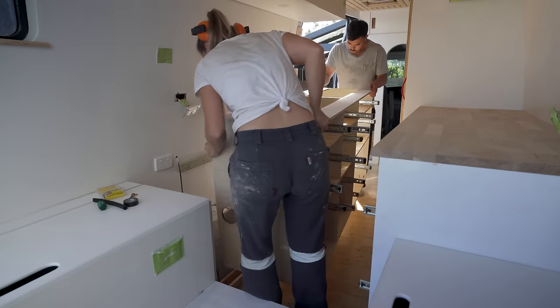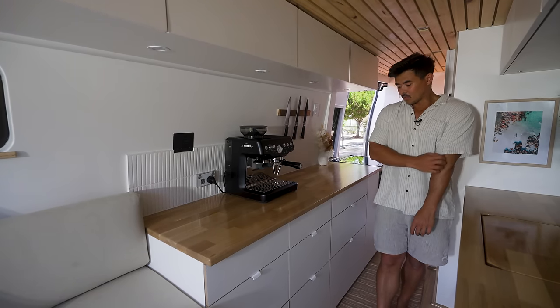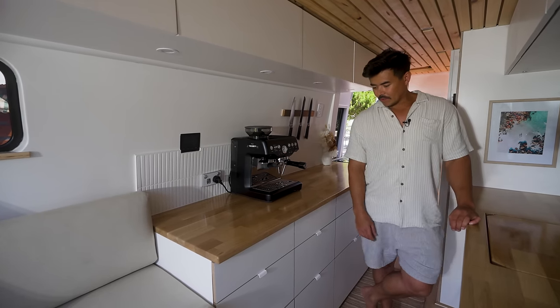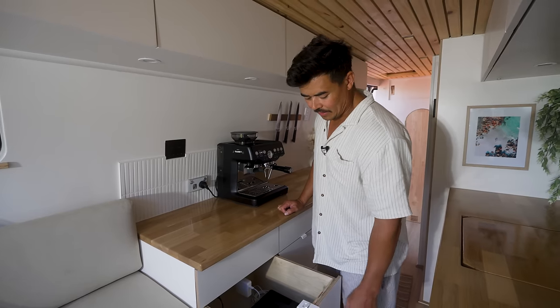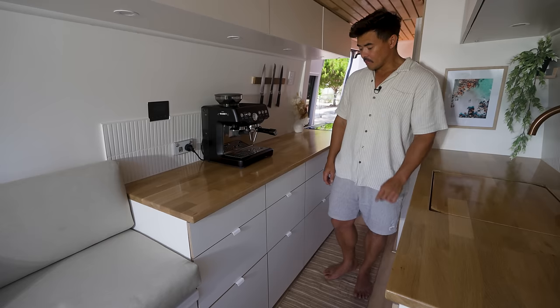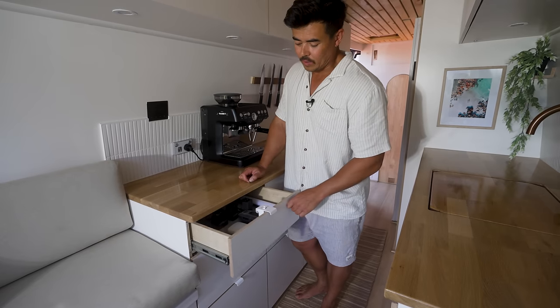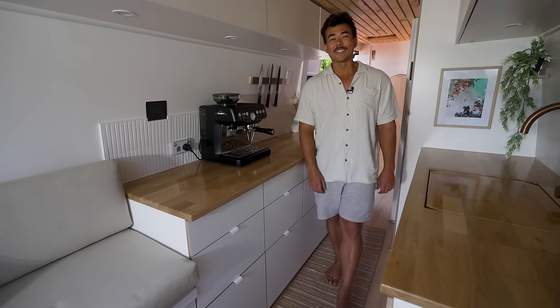Our cabinets are all custom-built, including the carcasses. We've gone for a minimalistic European style with flush-mounted lower cabinets — clean lines, modern, no unnecessary face frames. We used RV Labs latches in white, which look great with our cabinet faces and lock securely while driving. The ply is 12mm lightweight with a melamine face front and back — it looks great, is easily cleaned, and meant we didn't have to paint them.